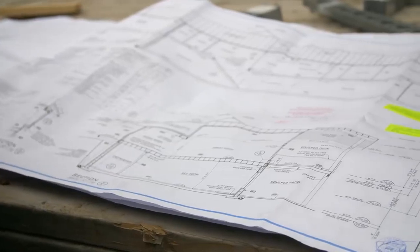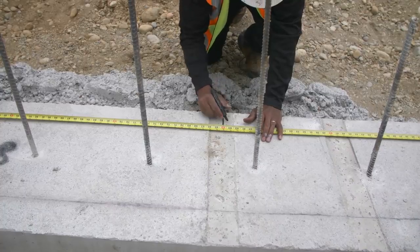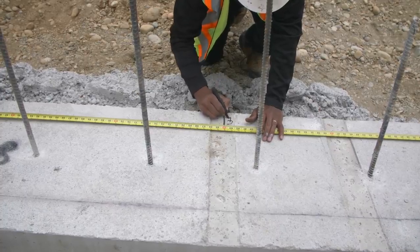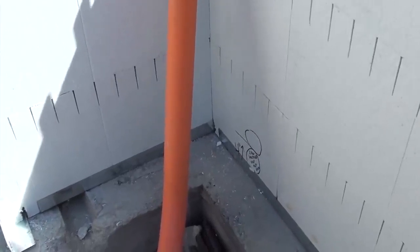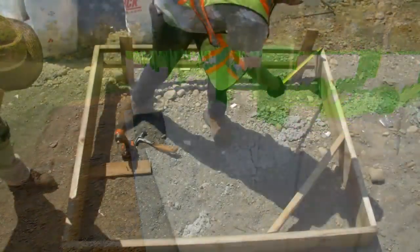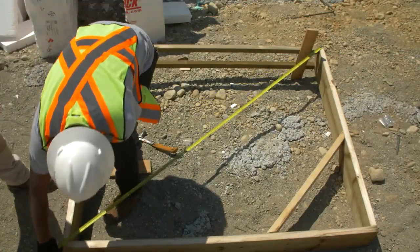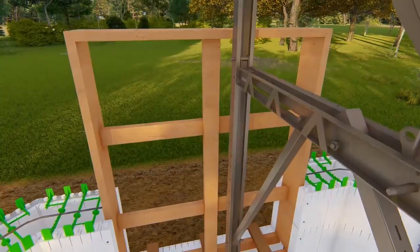Recheck window and door rough opening sizes and elevations. Be sure to account for floor finishes at door openings. Note positioning of electrical and plumbing supply points protected with sleeves through the walls. Plan and pre-build window and door buckouts. Openings should be internally braced both horizontally and vertically.